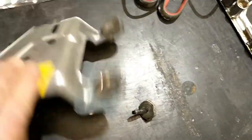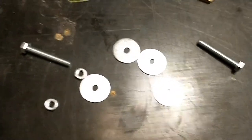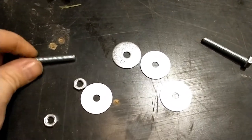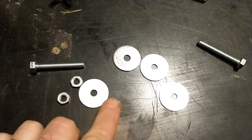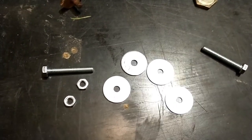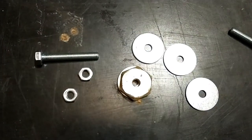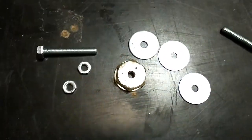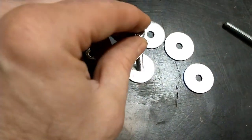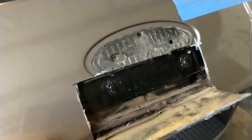So we're going to take a little trip to the hardware store. Back from the hardware store, I have a couple of M6 bolts, a couple of M6 nuts, and a handful of fender washers — all for about two dollars. I went with regular hardware, not stainless. Those fender washers are the right size on the exterior; however, they're SAE size, not metric, so they'll need a little hole drilled in them to fit. I'm going to run the bolts through that backing plate, weld those on, and we'll have this bracket after a little bit of paint.